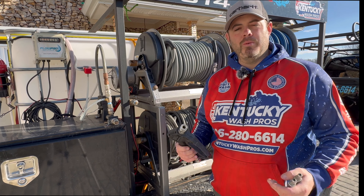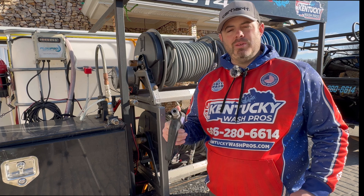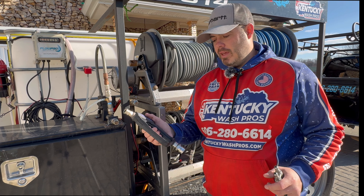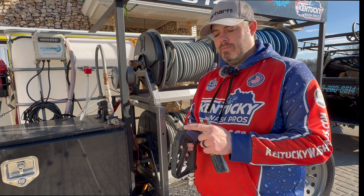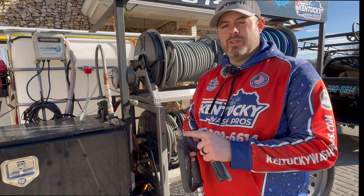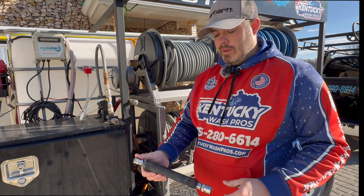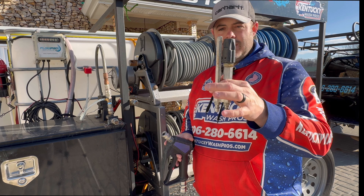I forgot to mention when we were talking about pressure washing hose — the pressure washing gun. We like to use the ST 2305s or the 2605s. They're a good gun with an easy squeeze trigger. When you get these guns they're not going to come with the quick connect connectors — you have to get those and put them on yourself. There'll be links for that stuff down below. It's really simple: get some Teflon tape, screw that on, and you're good to go. What makes this gun so good is this tip system right here.